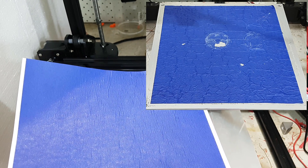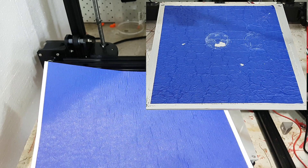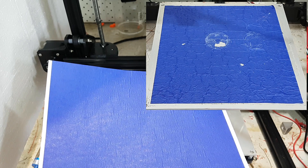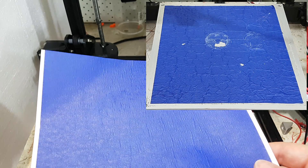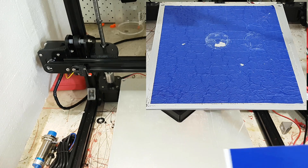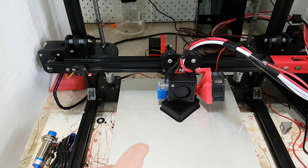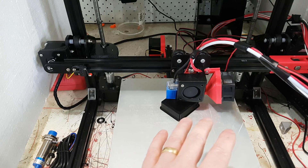The only problem that does really happen with them is that they do wear out, although they seem to last fairly well. Sometimes you actually find it sticks to the print when you remove it. But what actually happens - and you can see this in this picture - it gets bubbles in it. You take this off, stick it on the build surface, and it is flat, but the continual heating and cooling of the build plate results in that bubbling.